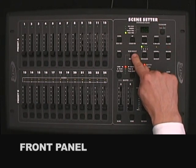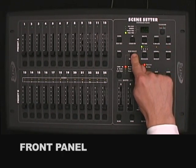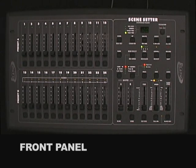The Mode Select Record Speed button. This is a multi-function button. Each tap will change the console's operating mode between channels, scenes, double preset, and single preset modes. The record speed function is used to set a chase rate when in mixed playback mode.